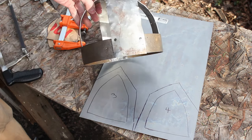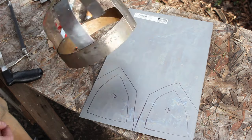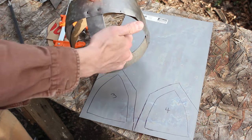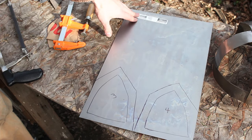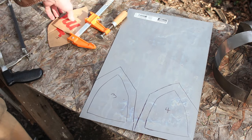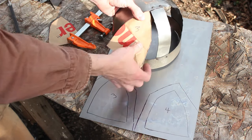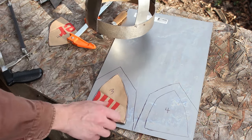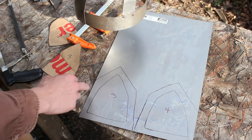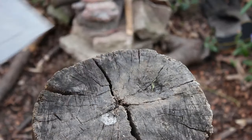I've got the entire helmet frame riveted together, so now I'm going to make the plates that go in between. I've got more 22-gauge sheet metal and cardboard cutouts that correspond with each panel. I've got that laid out on here with a little bit of extra room, and I'm basically just going to cut those out and then dish out the shape.